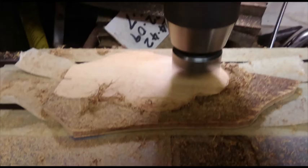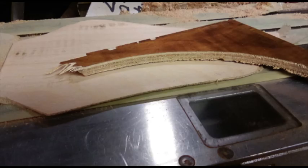The section of the walnut veneered ply I wanted for the headstock needed to be slimmed down, so this is just going on a fly cutter and a milling machine to take its thickness down. You can see here what I ended up with underneath a sample piece of the original. I'd like to have gone thinner, but it becomes a bit too delicate using that fly cutting process, and I don't really have a flat sanding means to get it any better than that, so I just took it down by hand to balance it, and that's good enough for me.